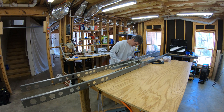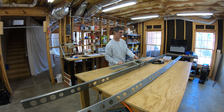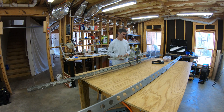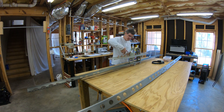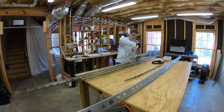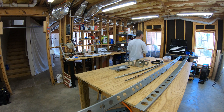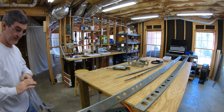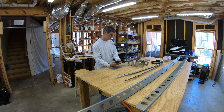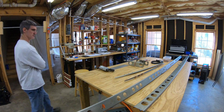It all looks great - everything's going to line up fine, so no worries there. That's why I have the spars out and I'm going through a whole bunch of messing around before I get up the courage to finally start riveting things together for real. I also toyed with the idea of doing the riveting while it was attached to one of the spars to use that as a holder or stand. In the end, I keep relearning this lesson that it's rarely helpful to have more stuff clicoed together than necessary when you're riveting certain sub-assemblies, because it just removes degrees of freedom that you may need to get at things.